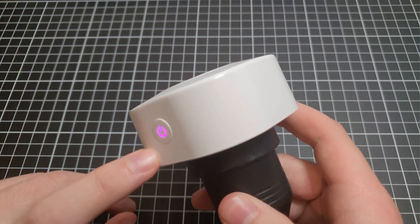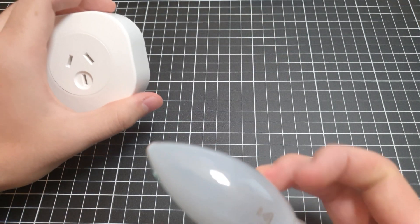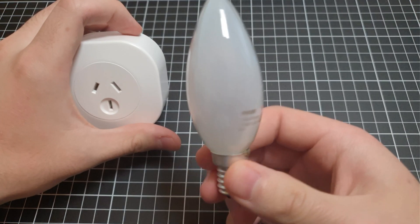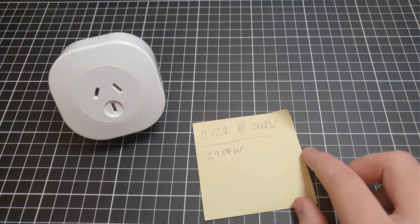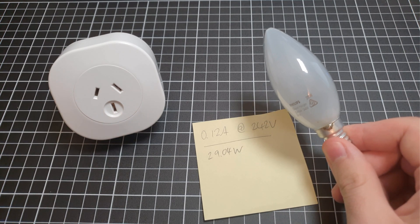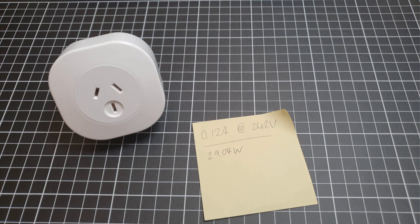So just blinking blue — oh, pink light, that's nice. The next step for me is just going to be calibrating the power monitoring. All that involves is taking this light bulb, rated for 28 watts — that's a purely resistive load, mostly just to calibrate the current sensing. It is actually 29.04 watts, but I'll do that later off camera. And that's about all there is to it. Thanks for watching.